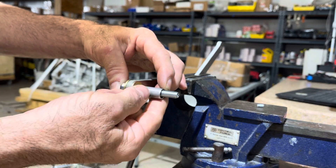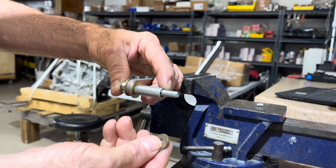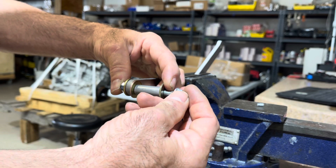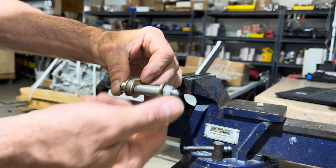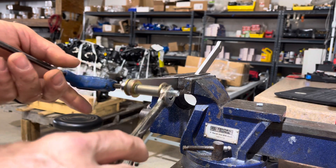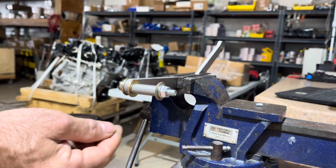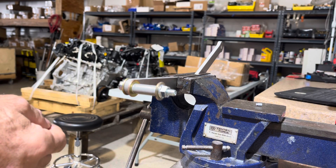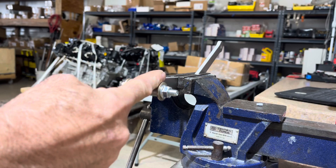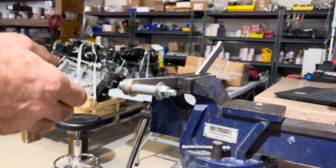Then there's a little steel collar — the bushing that we pivot around. Then the same on the other side: fairly thin edge on here, so we put a steel washer against it, and then we tighten that down. We have a very rigid pivot point that our flaperon can pivot around, and we have steel at each end for sideways bearing load. In real life there's no sideways bearing load here, so is it necessary? Don't know, but they're there.